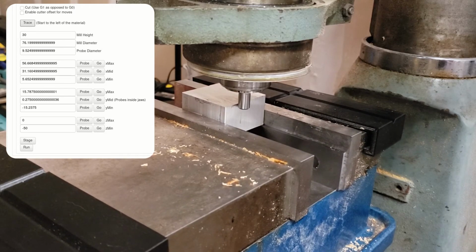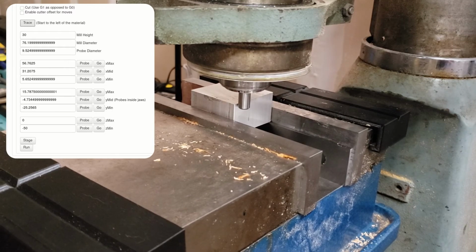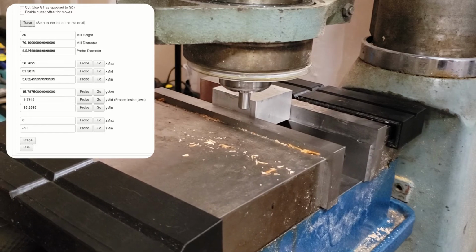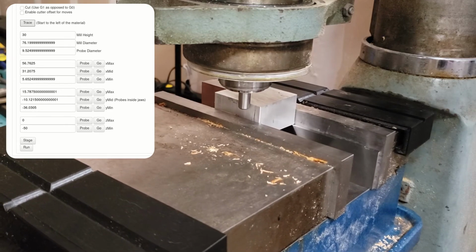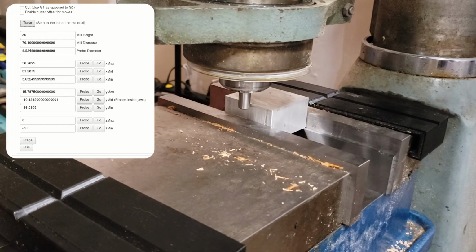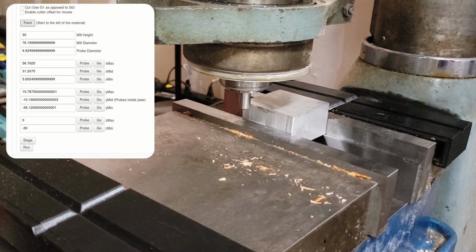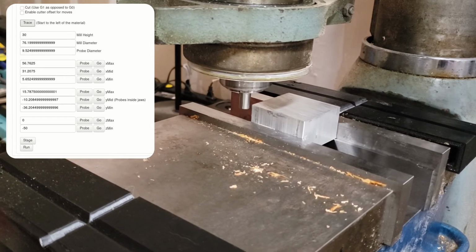And so therefore, with a little bit of logic, which you can look through on GitHub, which I'll link in the description if you're interested, it can walk around the entire piece of stock, figuring out all of the dimensions as it goes. I've thought about making this more efficient, having it just go up and touch the stock and then drag along, as long as the probe stays in contact, and then it knows when it gets to the other side, because the probe comes off and disconnects from the piece. But I have a few concerns there around, what if the sides aren't very straight and things like that, and I don't want to be marring up the workpiece.